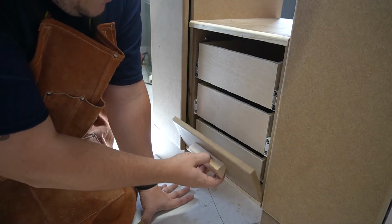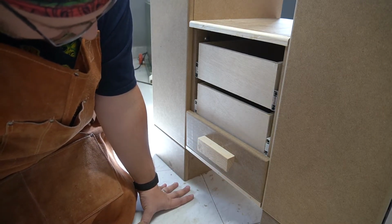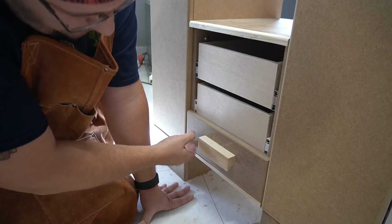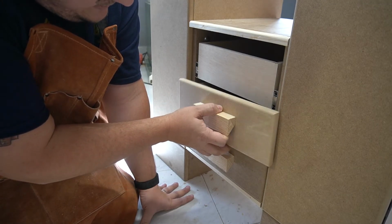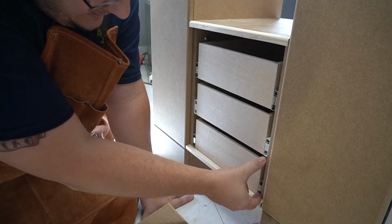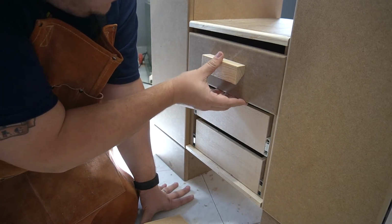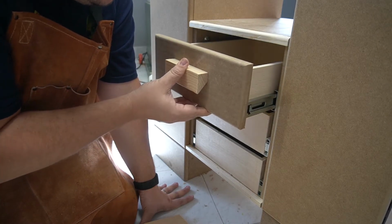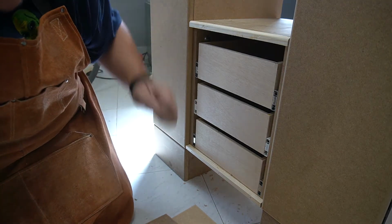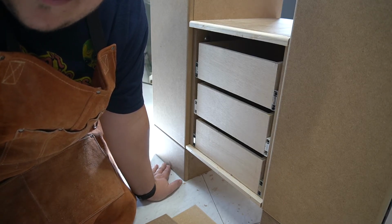It also means that the faces of each drawer will have to be cut down to different sizes. Now that's a problem. The reason being is this one I can cut down just a little bit, maybe at the bottom, that'll look fine. But the next one on top, I guess these two drawers will be the same because I need that distance and that distance. But then the top drawer will be too small because if I align this at the bottom of that, I have that horrible massive gap at the top, right? So I think I'm gonna have to leave that for the next video. This video has gone way too long. I'll do that in the next part at the very first step.